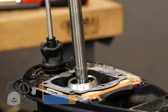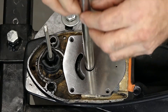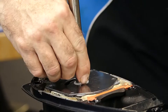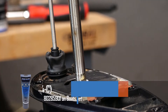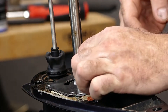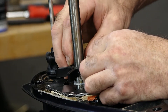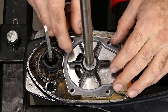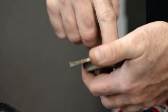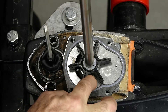Now with all that out of the way, we can actually start putting it together with parts from our kit. First we put down the new gasket, then the wear plate — you'll notice it only goes one direction. Then you put on the first nylon washer. Here's a little trick: you want to put a little bit of grease on the input shaft. That'll give the actual impeller key a place to sit and it won't fall off quite as easy. Now you can bring down the impeller and your second nylon washer. Then you can bring in the other gasket. It's going to be important to go ahead and grease the housing and put a little bit of grease on the wear plate because we're going to be doing a dry startup and it will prematurely wear the impeller itself.